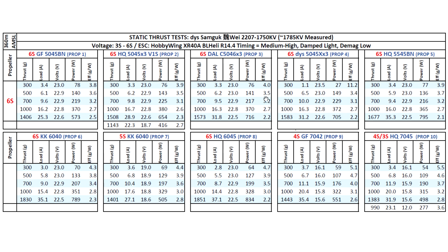With that in mind, you can decide whether this motor is good for you. With the lower power, one advantage — if you want to call it that — is that the motor is drawing less current than the more powerful motors, so it's going to discharge the battery at a lower rate, meaning you might get a slightly longer flight. On 6S, the 5045 prop is barely breaking 1500 grams, while other motors are making 1600 to 1700 grams — that's the main difference. The gap stays pretty consistent as you move up on the props, about 250 grams difference for max thrust.